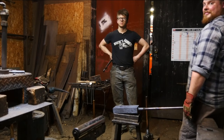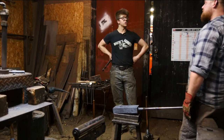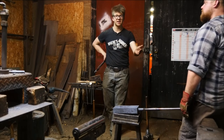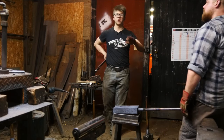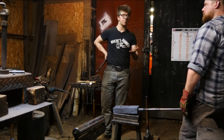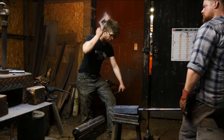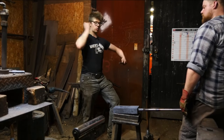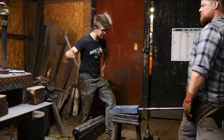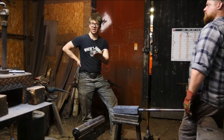What do you use this anvil for primarily? Apart from striking on, I also use my hot cut there. I have my hot cut there because that way it's off of my normal anvil, a little safer. It means I can also use the holes on my normal anvil. And it means the hot cut is a little lower, because the hot cut sticks up and out, and you're often cutting material that's a little bit thicker. It brings it up to a level that's a lot more comfortable to cut at, as opposed to having it way up here where you're bunching up your shoulders. It makes it a little more difficult. So really, if I'm working by myself, I've got a hot cut in the striking anvil the whole time. And then obviously working with a striker, essential.